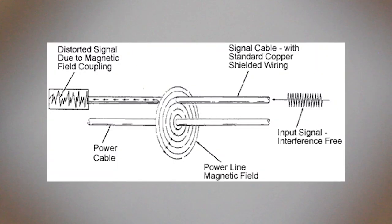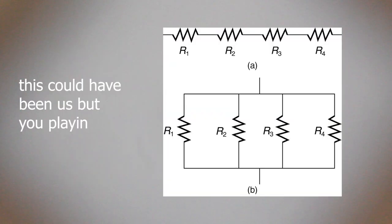After scratching my head for literally weeks trying to solve this, I'm guessing this has something to do with electromagnetic interference from the motor's signals. The currents drawn generate magnetic fields that interact with the wire that is connected to the sensor, causing a false positive. I thought I could add some resistors and be done with it, but I actually came upon a really interesting discovery.